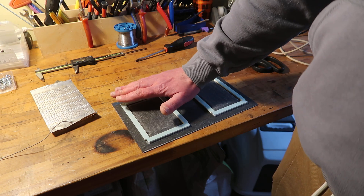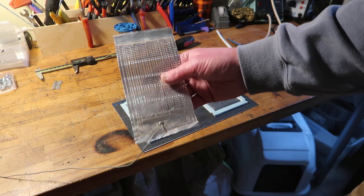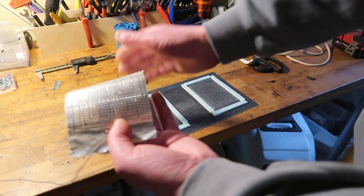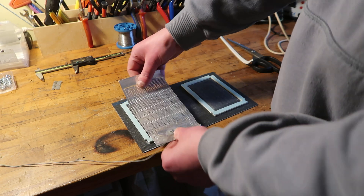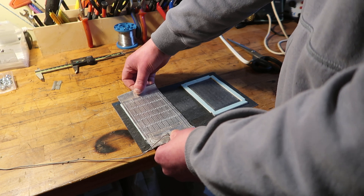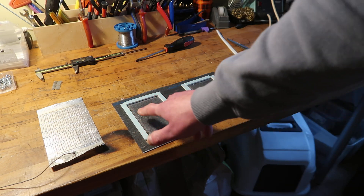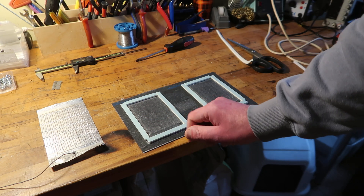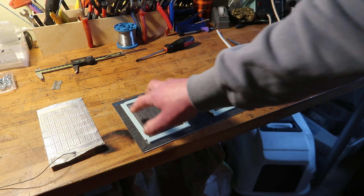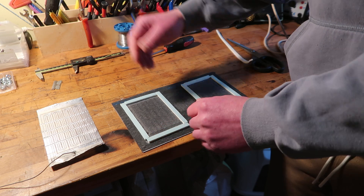If I can use corrugated foils here with the sticky version I did on my tweeters, and another kind of membrane. I had these pieces to give it stiffness sideways somewhat, because normally this resonance would be like 50 hertz — this panel is not meant to be playing 50 hertz. I'd rather have it at like 100 or 120, that would be insanely awesome. But this width, which is the only determining factor of the resonance, is probably too big. I might need to get this foamy tape more up to the magnet, or remove one magnet on both sides.